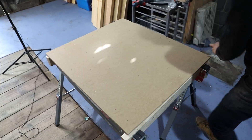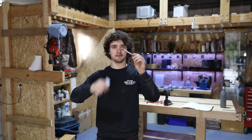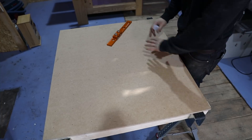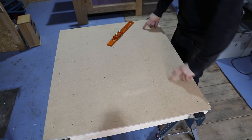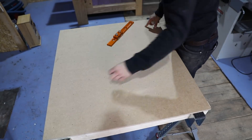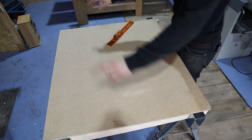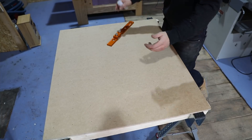So now we have a pattern of perfectly right-angled three millimeter holes all the way over this surface. Next we're going to use this little jig as well as a boring bit that is also included in the kit. This is 20 millimeters wide and has a three millimeter spur on it, which is going to locate in those three millimeter holes we've already drilled. You don't need to drill out all the holes to 20mm - I've done 3mm all over so I can expand it later if needed. But for now I'm going to do the first few rows all 20mm, the top two rows 20mm, one down either edge, then split it into four: two horizontal rows and four vertical columns. That should be enough for all my cross cutting and 45 degree cuts too.